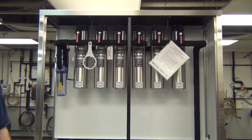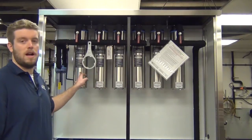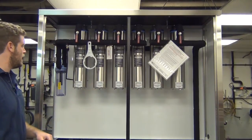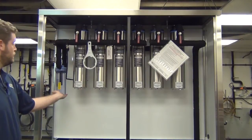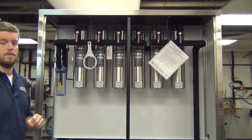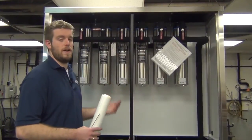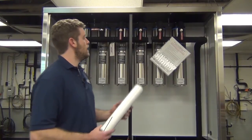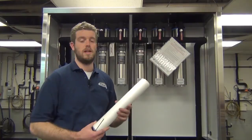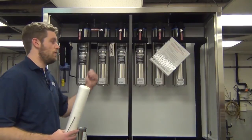On the back side of the chiller, you have the purifier cabinet. In this case, you have two pre-filters and then four carbon block filters in line. This is your wrench for removing the bottom of the filter or purifier housings. This unit is also equipped with a phosphate feeder that feeds glassy phosphate into the system to coat the inside of the pipes and prevent any leaching of metals or copper. Before installing the filter or purifier elements, you're going to want to check to make sure that they are in the right order. This particular unit has two purifier elements to take out big particulates and debris, and four carbon block elements removing chlorine taste and odor from the water going into the system.